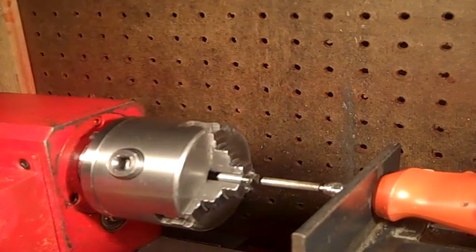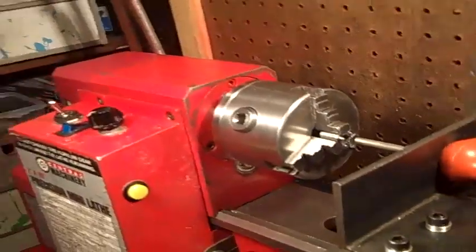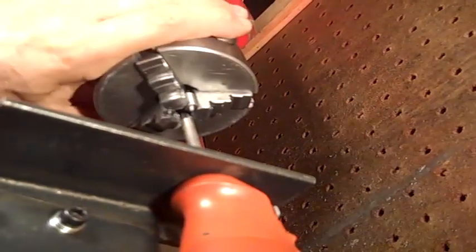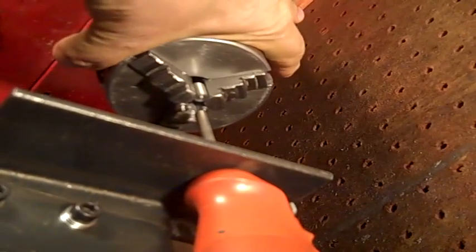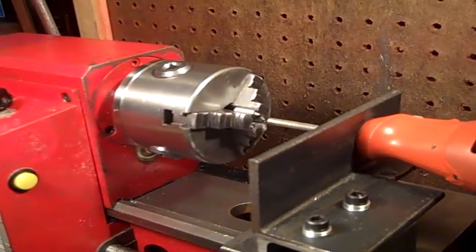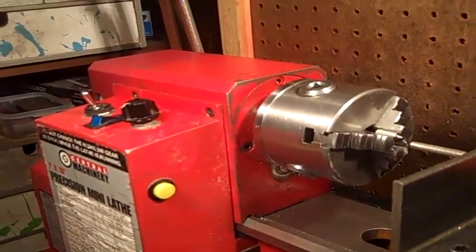And the idea, I have those jaws. I'm trying to get this over there better. You can see that. The jaws have .2, I think they're .22 inch drill rod spacers, 3 of them. And I've tried different sizes, and the bigger sizes didn't work, but you could probably use 1/4 inch.